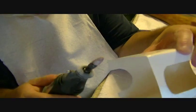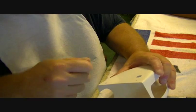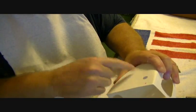See how it kind of fuzzes around the edges? You can take that off on the inside. I'm not putting any pressure to this when I'm cleaning off the fuzzies. I'm just barely touching it, and it just eats it right off of there, so it's very clean. You can do it with a hobby knife, but it's not as good. It doesn't come off as clean, and it sticks, and you can chip the edge of your fiberglass. This comes out really smooth.